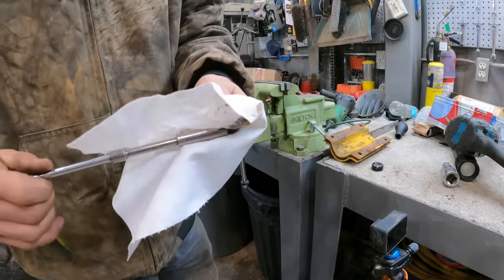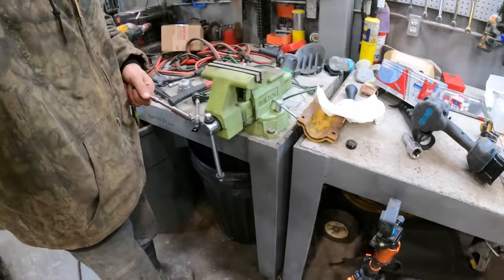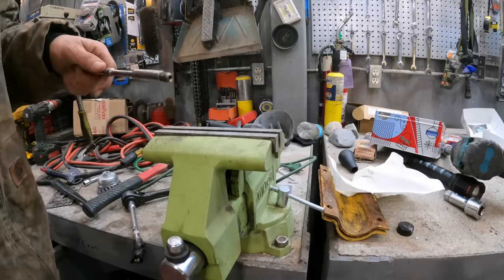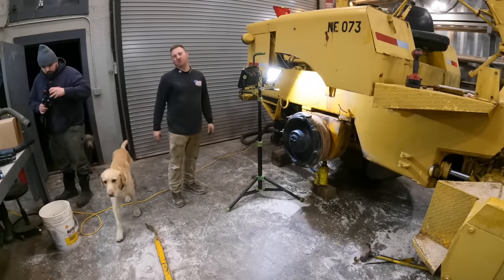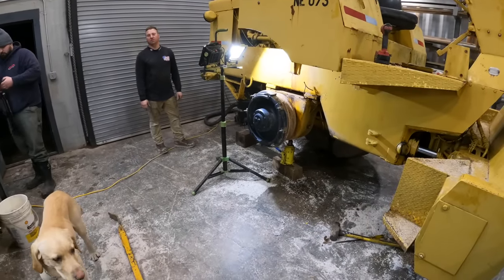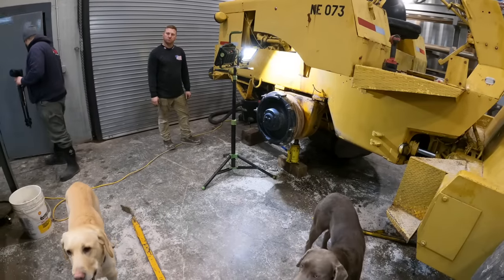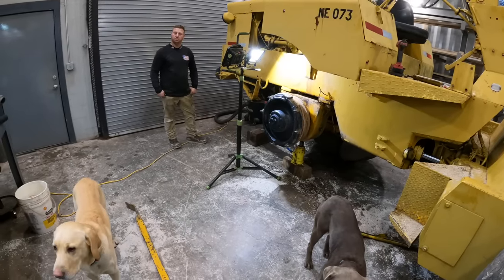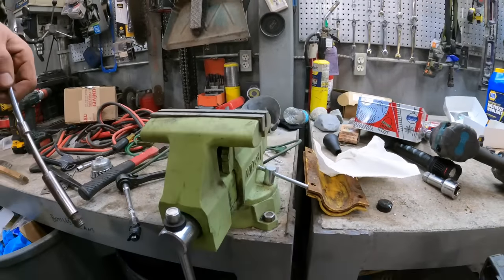The jack blew out, strap right down. Really? Yeah. I've never seen a bottle jack fail. The fluid came right up on the piston, just sprayed out, and it dropped right down. Jeez. I mean, even if that dropped down, it's only going to go down 2.5 inches. Yeah. Unless it broke the block. Yeah, if the block of wood exploded, then you got a problem. I had that happen on a Jeep once, the block of wood exploded, and then the jack went through the oil pan. And the Jeeps are not protected. This great off-road vehicle, and its oil pan just hangs out there.